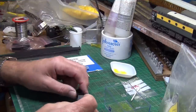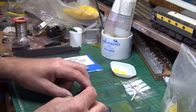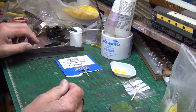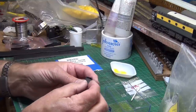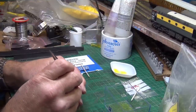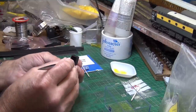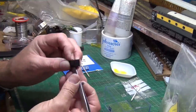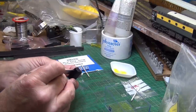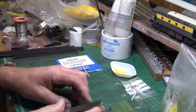You need an item to go inside, and what I use is this foam board. You could use anything, plastic card or anything, it's just something to fill up the hole in the trough. So you just cut it to size and then push it inside the trough to pack it out, really. Just push it until it is level at the top, but held back by the frame that holds the chip. It's not going to be seen, so it doesn't matter. It's going to be held in there by the epoxy glue, so it really doesn't matter if it's perfect.